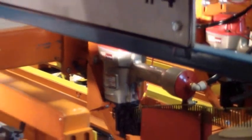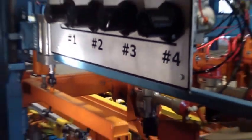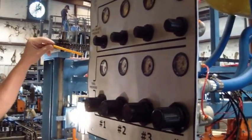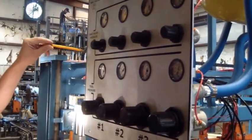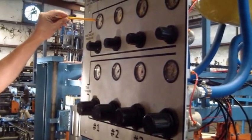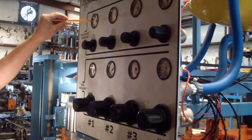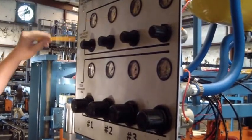With the max tools that are on here, you want even pressure. The differential pressure is different on different brands. A Stanley tool likes about 5 or 10 pounds less on the tool fire. Max, Paslode, a few others like even pressure.